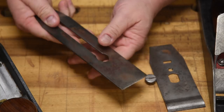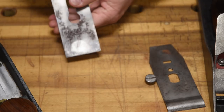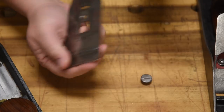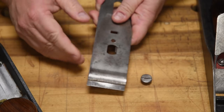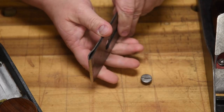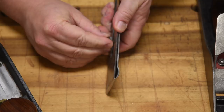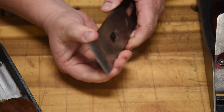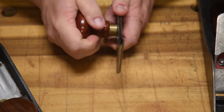Now, if you were to cut with just this blade, you would get a lot of chatter because the blade itself would vibrate. You can flex it with your hands. And as you're going through the wood, if you've ever seen those chatter marks, that's typically caused by the blade flexing. So what they did, not only to increase mass but to put the blade under tension, is they created these chip breakers. And the chip breakers have many other purposes. I have another video talking about chip breakers from a few weeks ago that I'll put a link down below to. They added mass, but they also put the blade in tension, because whenever you assemble this chip breaker to the blade, it squeezes the spring down. So it acts like one big piece of metal that has a different thickness throughout. It's a little bit thicker down there than here, and that counteracts a lot of vibration, if you understand a little bit of physics.